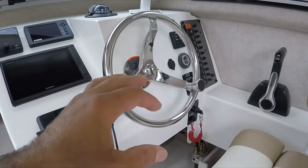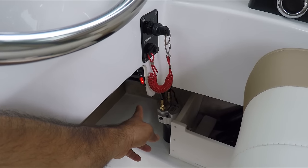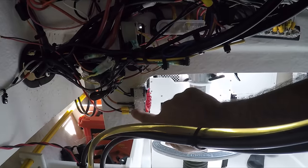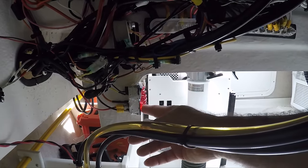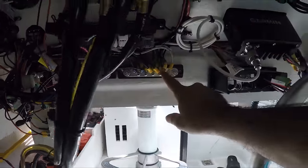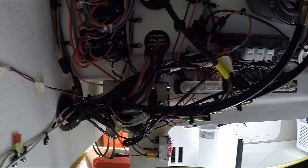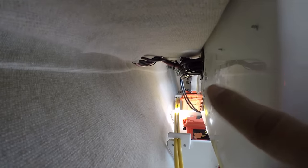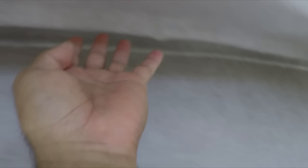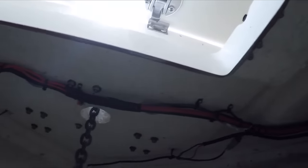Now I'm going to show you how the wiring looks. The switch here is perfect — see how it lights up. This is a special switch because it lights up when you turn it on. It has to have one positive and two grounds to make it happen. I've got my two negatives here and my positive one here going to the main bar. The wires came right through here, all the way down, all the way through the foam, right around the corner through this area here.